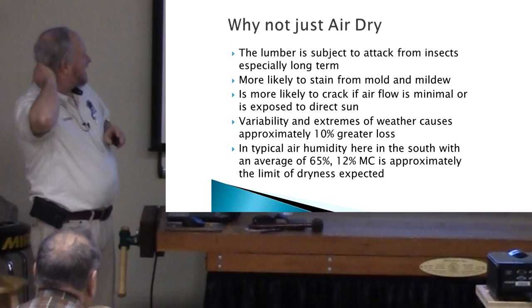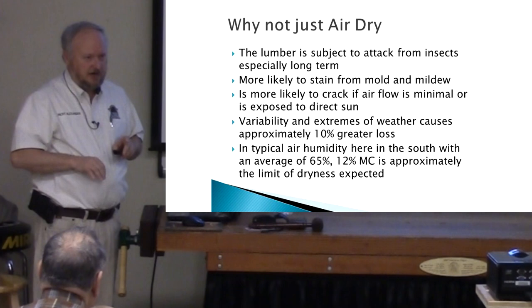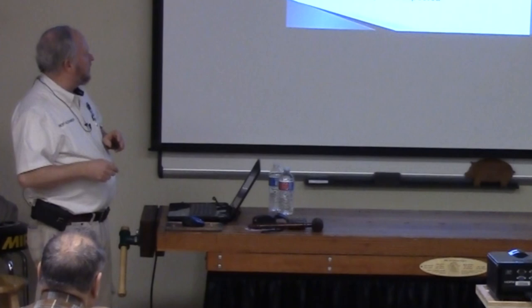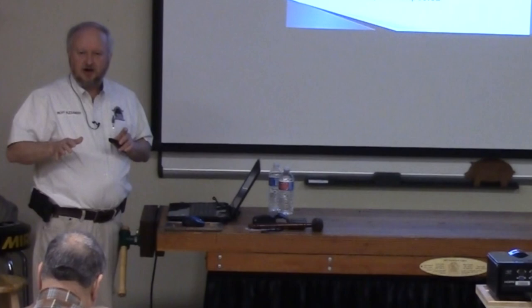That's why we try to avoid cutting in the summertime. It's more likely to crack if airflow is minimal or if it's close to direct sun. In other words, if you don't take your time to do your stacks right — go too wide, too tall, or maybe the weather just doesn't cooperate — you'll get a lot more cracking. So having a kiln to speed that up might help with less variability from weather. You can count on 10 percent loss even after you cut off your checking on the ends, even if you didn't get your ends sealed.